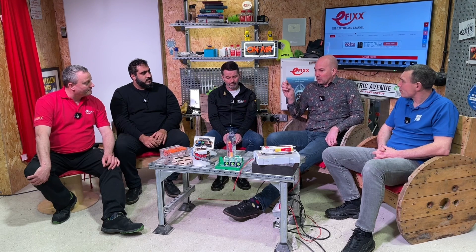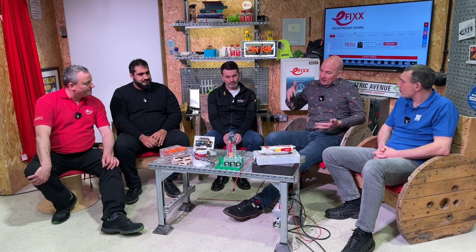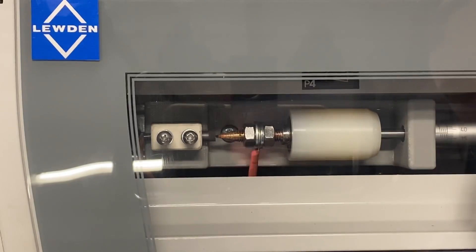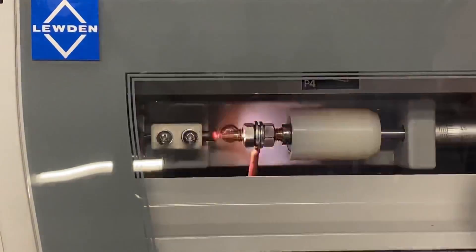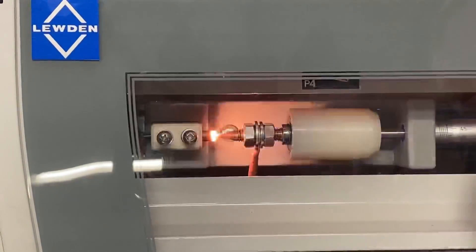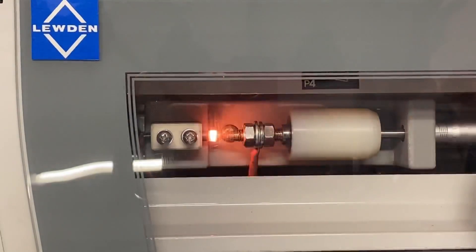To get a sustained fire from a screw connector, you need an inline resistance - not a fault between conductors, but resistance that causes heating while carrying current. For that to lead to a fire, you need a series of events to align and dissipate energy for a prolonged period. It might just be that lights stop working. But if lights are flickering for a prolonged period, that can lead to these events. Either a proper torque setting on the ceiling rose or a levered connection would have prevented it - both give a reliable electrical connection.